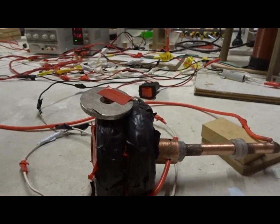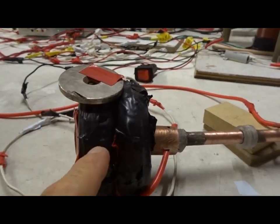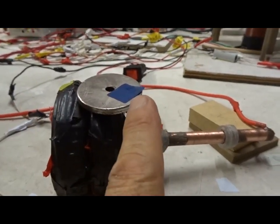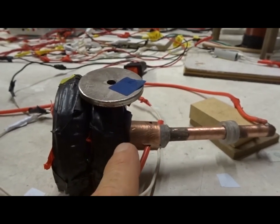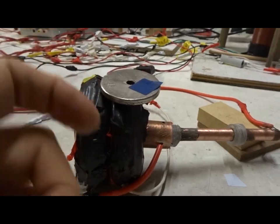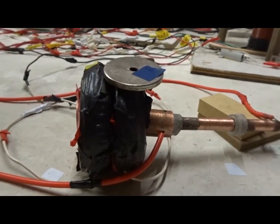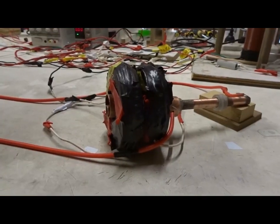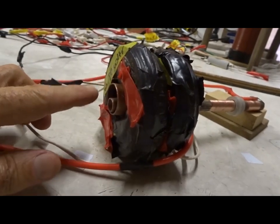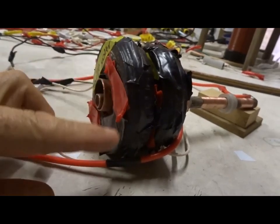On one side of this device, the radial magnetic field is north-out red, south-in blue. On the other side, the radial magnetic field is south-out blue, north-in red. So on this side the fields point in, and on the other side the fields all point out. We have axial fields and radial fields. As I show in many movies, the axial magnetic field just makes that blue arc of ionized argon spin either this way or that way, depending on how we set the field.